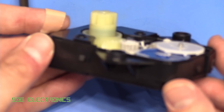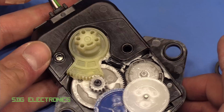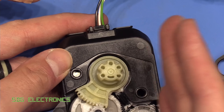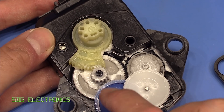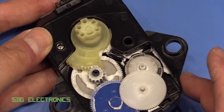Here's the swivel motor for the headlight unit. I've just taken the top off and it appears to be basically just a servo motor — power, ground, and PWM — where the PWM sets the position. There's a motor underneath with gearing down to the actuator that actually turns the headlight around.